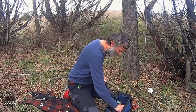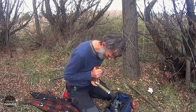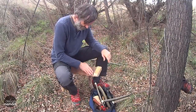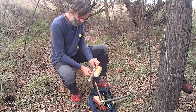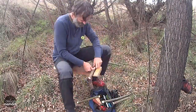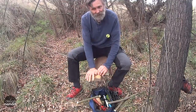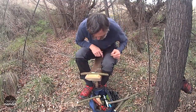So, I really do need my carving stool at this point in time. I need to sit on my stool and I'll drive that fella in there like that, but I'm going to stick that right through my hand if I do that here now. This little stool I made some time ago is for doing just this sort of work. It allows me to hold a piece of timber up against a stop like that whilst just sitting. It's a very portable bench that you can sit on as well. So I can place my work in there like that and it holds it in place. I can even put my knees, my shins in there against there, and it's not going anywhere.